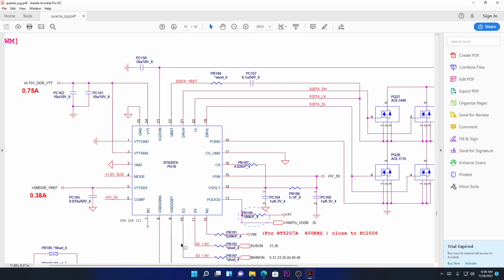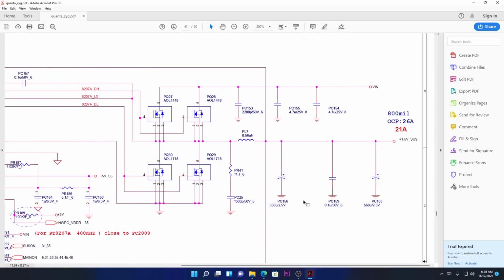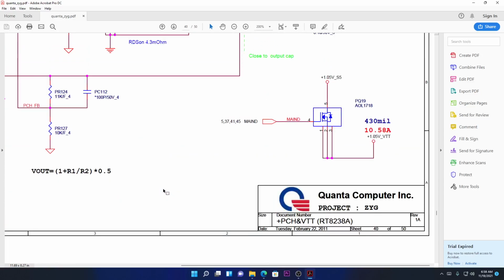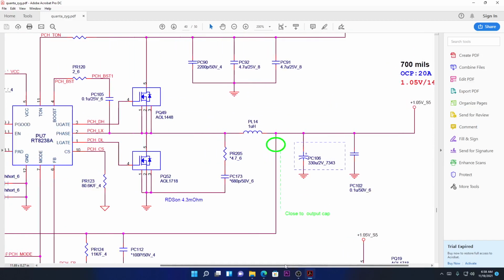All right, but anyway, this is how you diagnose the RAM power supply. You should be able to get 1.5 volts there and get this 0.75 volts. I'm showing you the most important things that you should consider or check when you are checking a RAM power supply, and check the resistance compared to ground here on the coil as well. Anyway, this is it. I will see you later, guys.